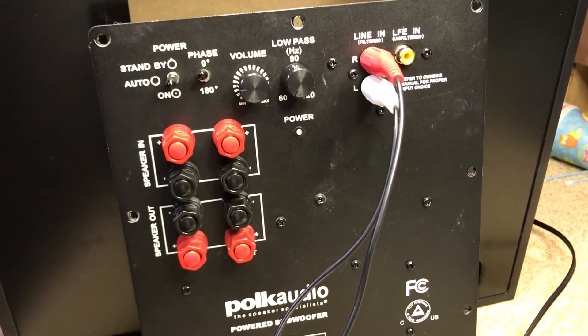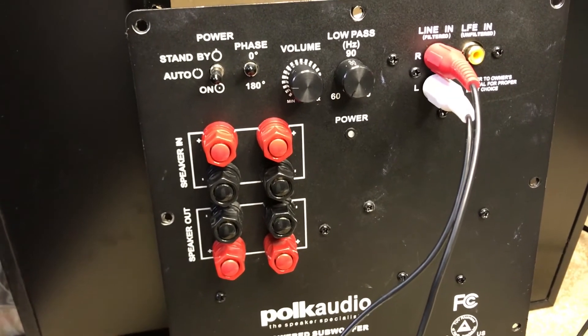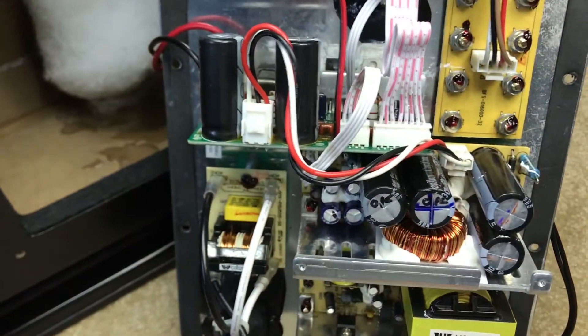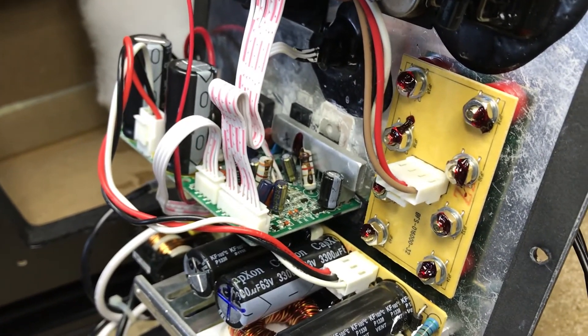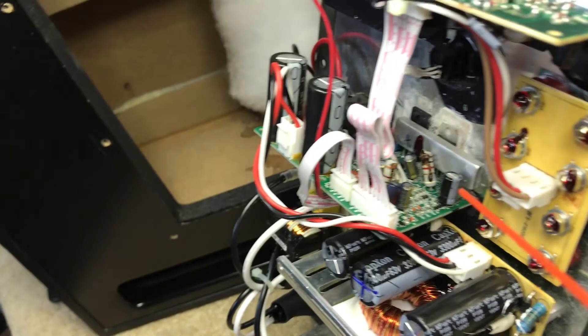Full disclosure: the amp would play fine for about 30 seconds with no noise — so the capacitors did their job — but it's shutting down after about 30 seconds. I've checked the power supplies again and they're measuring fine. I'm curious whether the amplifier itself is causing a problem. When something overheats you can often reverse the problem with freeze spray, so I have a can of refrigerant here and we're going to try it on the amplifier.